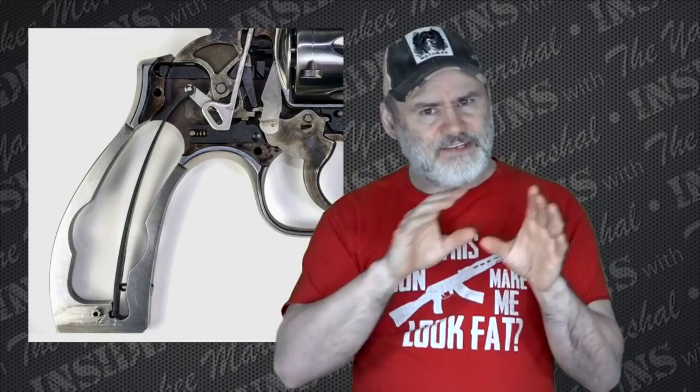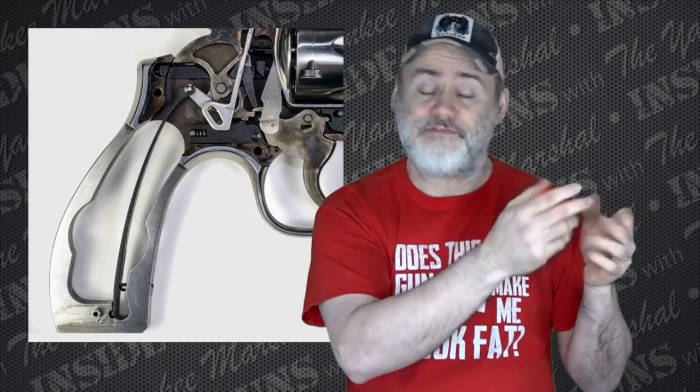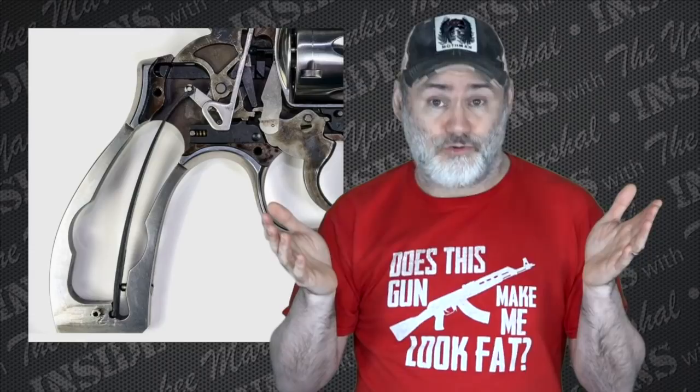You can take it down a little lighter, but is it really worth it? Is it worth shaving a pound or two off the trigger if the gun might not work? I was measuring trigger pull weights on my live chat the other night and we were getting around seven and a half, eight pounds on my Chiappa. Could I take that down to six? Probably, but why would I want to? It's not going to be that big of a difference, the single action will still be light, and I run the risk of making the revolver not work. Buy yourself a reputable spring kit from companies like Wolf or Wilson Combat and you'll be fine. But don't go monkeying with it yourself too much, because you can really turn a great revolver into a paperweight if you do it wrong.